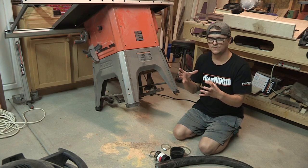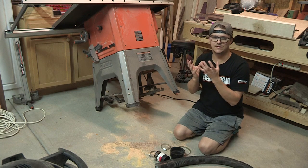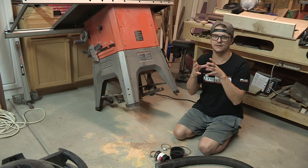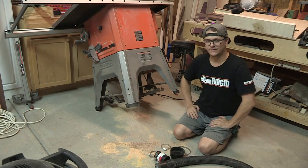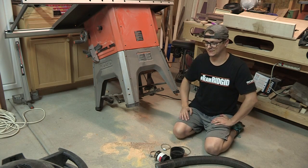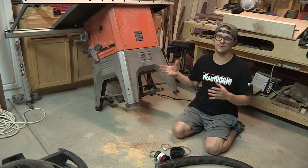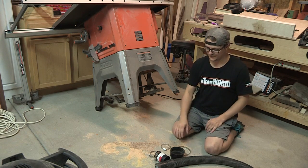So he had this idea. He used a reducer on the bottom of his table saw — it was a PVC reducer if I remember correctly. And then he had a rubber coupling meant for plumbing or something similar. I said that's actually a pretty decent idea. He had used tape and tried some different things. I'm going to try something a little different — same concept, but if you have a four inch dust port going to a shop vac like I am, this will hopefully work for you.